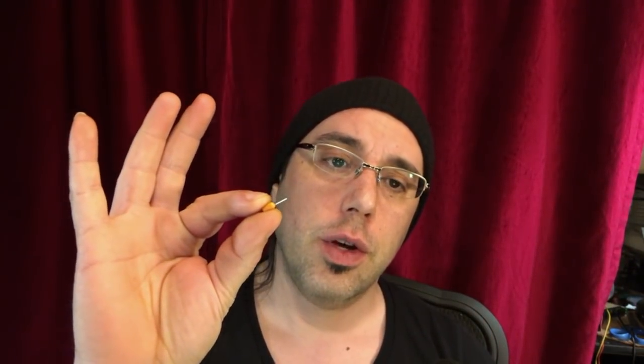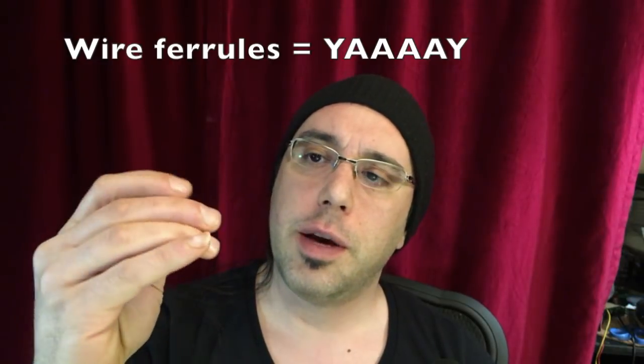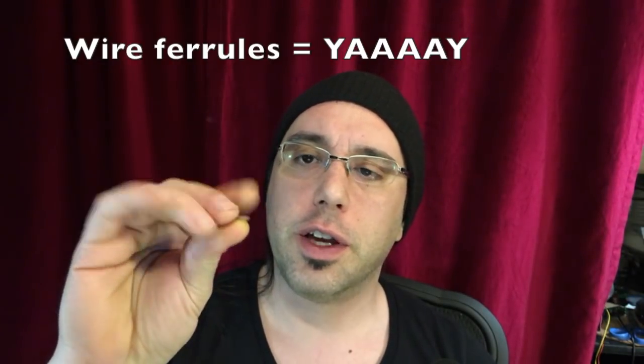You want to take those stranded wires and simulate a solid wire as best you can. But even better is to use wire ferrules — this happens to be an insulated wire ferrule; they come in uninsulated as well. These usually go with the European pin type connectors used on these boards. We don't see a lot of these in American equipment because we use different terminal types here, but 3D printers use all the Euro stuff, so just get used to the idea.